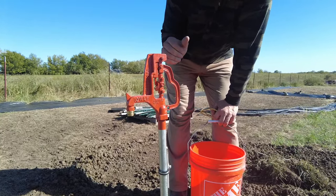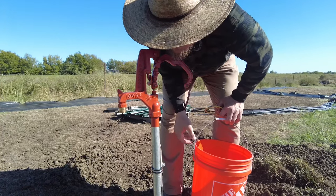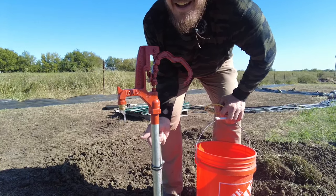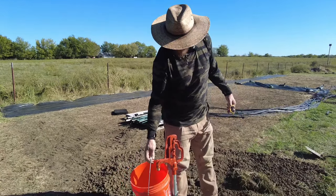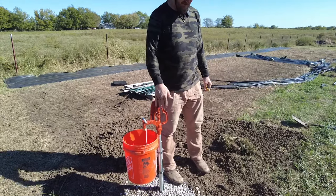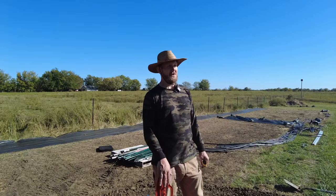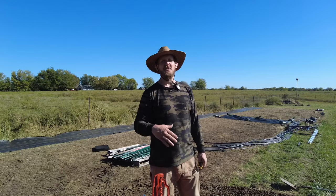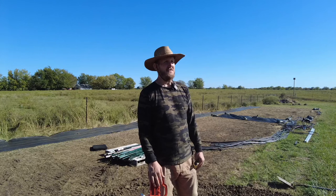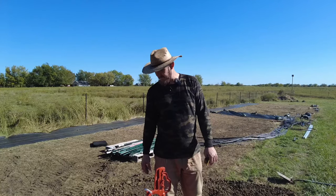You can hear the sound. You'll hear the empty sound of the yard hydrant when you start it up. That sound of it filling up like a whistle. That means it's draining properly, which is good because that's the whole point of them, they drain below the frost line. So yard hydrant's in, 50-foot line, but I'm thankful we live in Oklahoma where you only have to dig down 2 feet, because otherwise running in a water line, as you get further north, you have to get a backhoe, and it's an even bigger mess than this in order to get this kind of functionality over here.